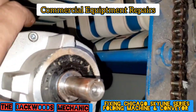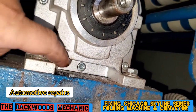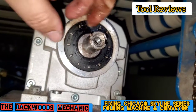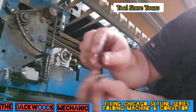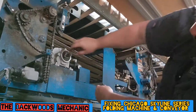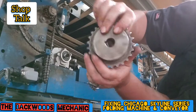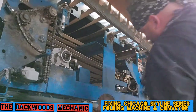I'm going to make sure to check the oil — we got an oil plug right up top here and a drain hole right here, so we can drain the oil, change it, or just check the fluid level right here. I'm going to put my stethoscope on here and turn it just to make sure everything sounds good before we reassemble everything, because we got some new keys here — different size keys. I got this shaft cleaned out real good and the sprocket cleaned off. We got our one-eighth set screws and our little Woodruff key-way.